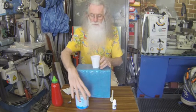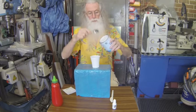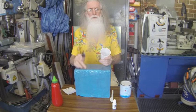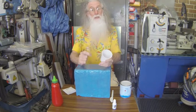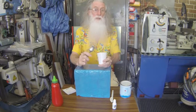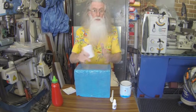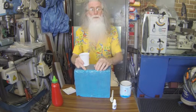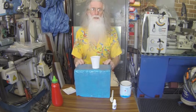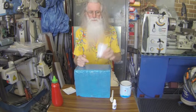But the trouble was, when you're spooning it out, and that is why I use the metal spoon, it drips over the scales, and actually the plastic parts of the scales, the cover, were being attacked and melted a bit and blended with the resin. So my advice from my experience is that you put your scales down, put a thin piece of plastic on it, and put your empty cup on, weigh it. I think by memory this is about 37-40 grams, let's just say.